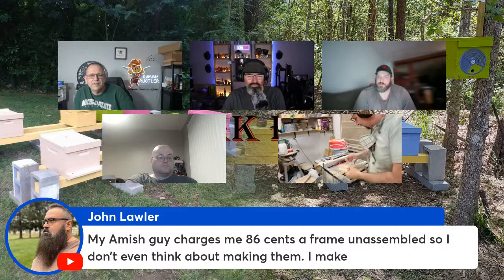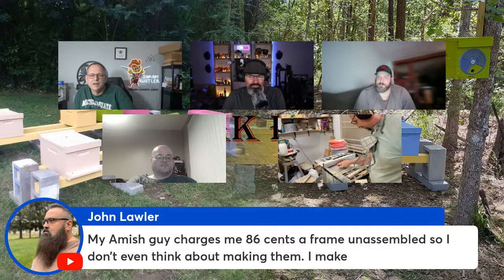Where I'm having problems is when I get to the last one, this little sliver falls down in here and binds my blade. So what I'm going to try to do is take some duct tape and put it right up to the edge so it maybe won't fall down in there. The zero clearance. Duct tape fixes everything, exactly.